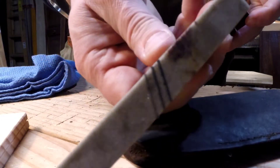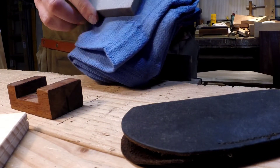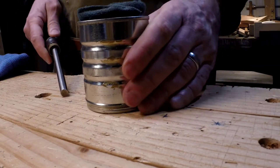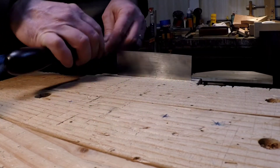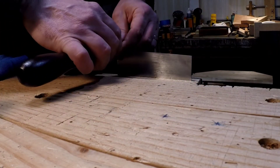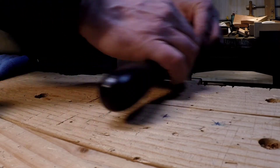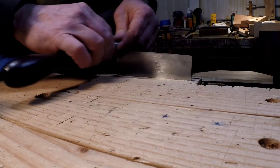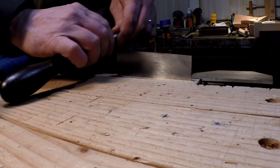The jig is very useful for sharpening because there's a radius on my card scraper. The final step is burnishing with a rod of hardened steel — harder than the material you're burnishing. Some people lay the card down to draw out a little metal and then fold it over, but I skip that. It means you take more strokes when it's upright in the vise, but I'm not precious about that.